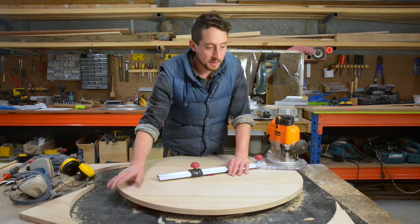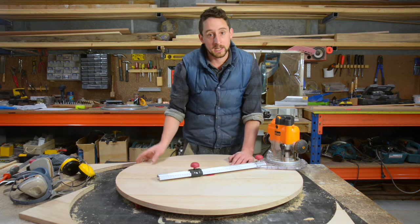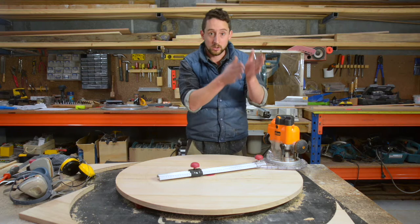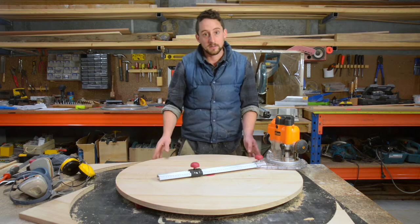The spiral bit did its job. We went through it about half — I think it was two mils at a time, four passes — but I'd like to do one more pass around the whole edge now that I'm not actually cutting through material, just to take half a mil off the entire thing and hopefully get that edge a little bit smoother. All I'll do is pull this radius in by a little bit less than a mil and then run around again — hopefully that'll just shave off enough to give me a really smooth edge.